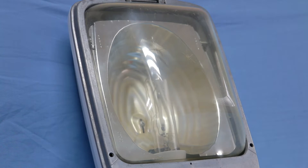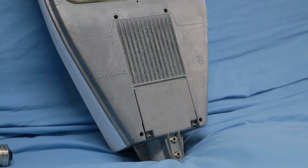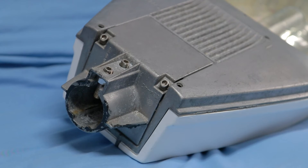Here's a quick view of the other side and the bottom. You can see a nice heat sink from the control gear, the manufacturer's name, and the spigot mount. The whole frame is made out of cast alloy. The main mount slides onto the end of the spigot and is secured by two very large grub screws. The whole assembly can be removed by those two cap screws and repositioned the other way, so the lantern can be mounted post-top.